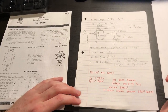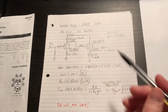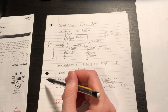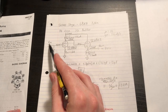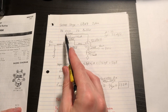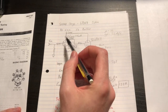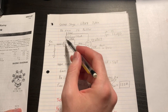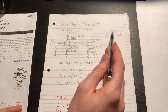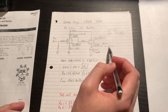The idea I had for a combination second gain stage and driver for the 845s was to use a 6BX7. The 6BX7 is an octal twin triode, really like a miniature power tube. I was thinking of AC-coupling our 6SN7 mu follower into one half of the 6BX7 triode for a common gain stage, constant current source loaded at approximately 15 milliamps. The mu of the 6BX7 is 10, which falls right into our acceptable gain range.